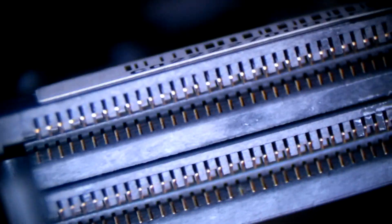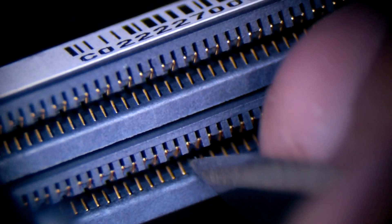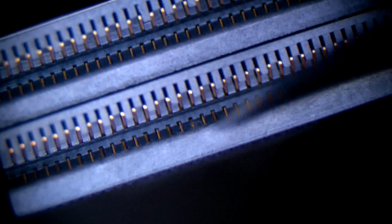With my X-Acto knife we're gonna use some alcohol — a little more right here so that it does not spread. Some more cleaning. You want to make sure that those pins move freely, so they should not be obstructed in any way, shape or form. This damaged pin has to move the exact same way as the pins next to it.